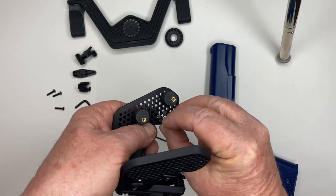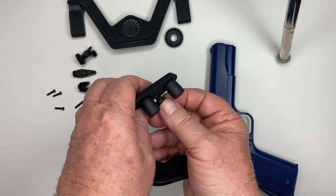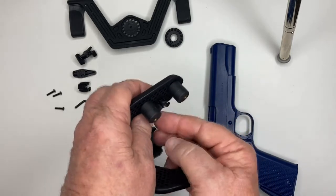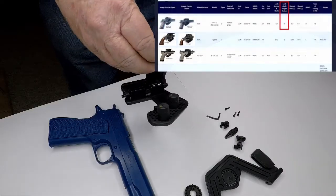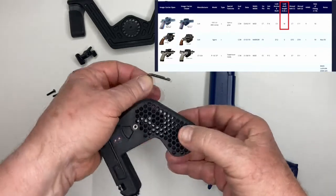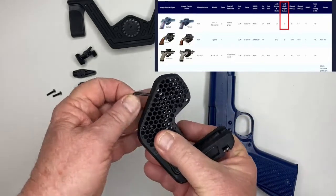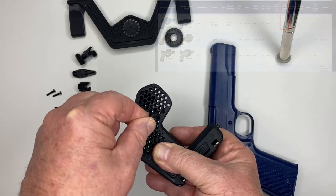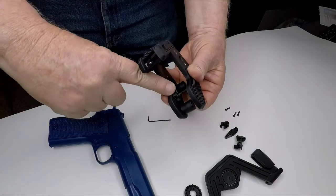Install the anchor over the lock washer with its broad lugs away from the side plate. As with the registration pins, leave the anchor loose for now. This fit calls for a medium length shaft. Note the notch on the shaft. The shaft always goes through the opposite side plate toward the anchor's center. This method eliminates the need to look up the hole position of the shaft using the database.